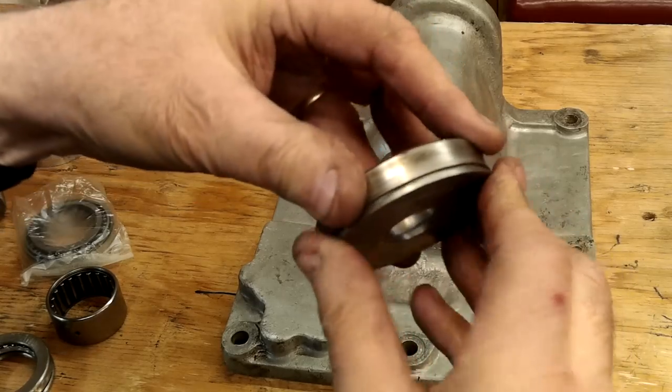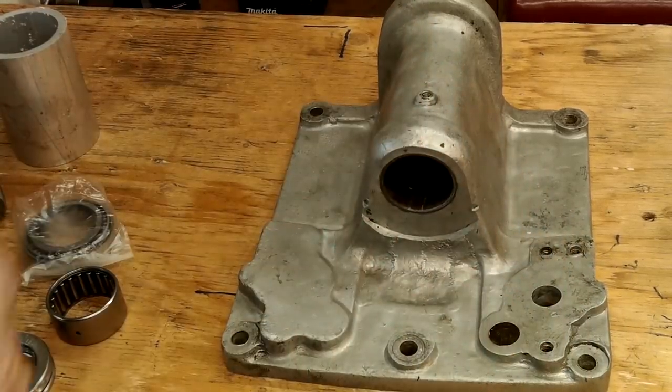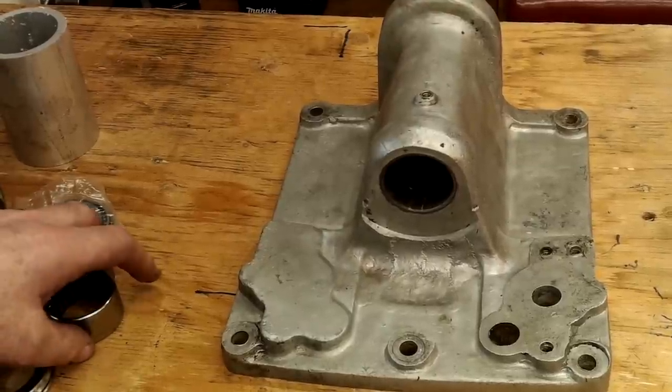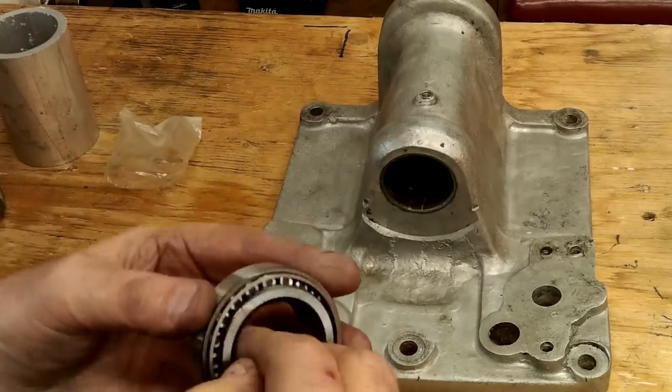Because of this unique steering system, the steering gears become distressed and wear at an unnecessarily fast rate. Instead of using conical bushes in the bottom of the steering head, I'm going to use a taper bearing.